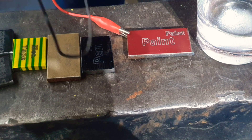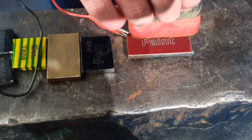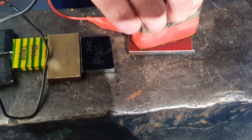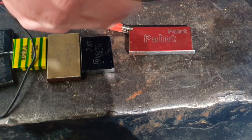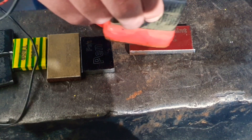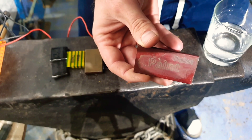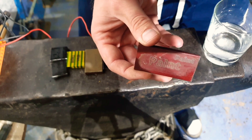We're plugged in and ready to start testing, so we'll start off with the paint. First thing we need to do: apply the salt water to the applicator. We've already got our positive clamp connected, so it's time to switch the machine on to etch and see if this does anything. I'm going to etch each piece for 10 seconds and then mark for a further 10. I ended up etching for 30 seconds in total and then marking for another 30, so we'll mimic that for all the other pieces. That actually seemed to work quite well — a decent first runner.